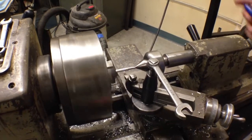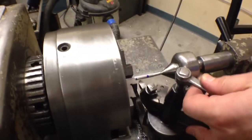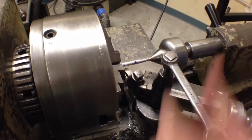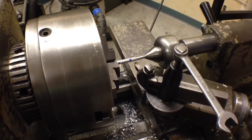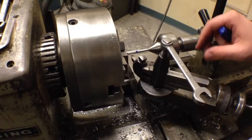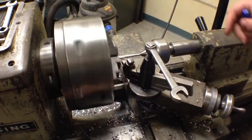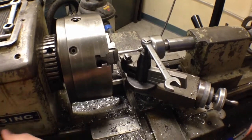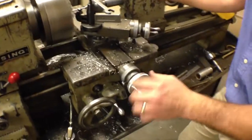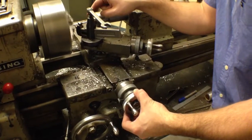I have to be careful working in close to the headstock like this. Notice my tool is kind of pushed over pretty far, and I'm actually going to rotate this a little more. Most of this will be set up for you already. I'm going to check my tool height — I'm good. I'm going to work over real close to the headstock, rotate by hand to make sure I'm not contacting anything, and I'm good. I'm going to go ahead and start this up and turn in the cross-feed dial slowly until I see material being taken off.